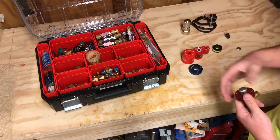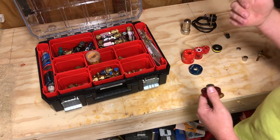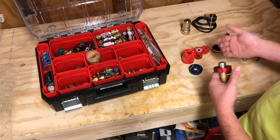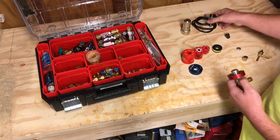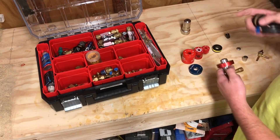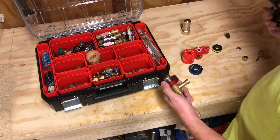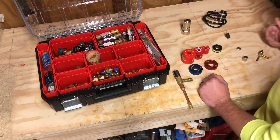You want to get the system back into a known position — whether that's turning the system off with all valves going shut, or a force-recovery position where you drive the valves open. This would be necessary if you're replacing an EEV coil or something similar — it's a good idea to get the valve body back into a known position.